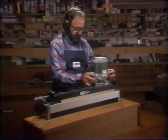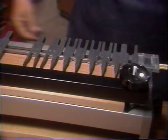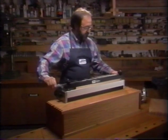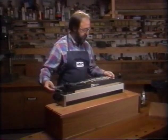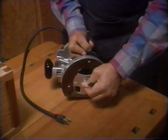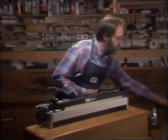While you are cutting, keep the router base flat on the guide fingers. When your tail piece is cut, remove it. Replace it with your pin piece, face side out, away from the jig. Remember, always put your workpieces against the side stop and flush up to the guide fingers. Now rotate the finger assembly back to the TD pin mode. Temporarily set the TD pin scale to the size of the dovetail cutter you used to cut the tails. You will need to change the cutter in your router because in the pin mode we will be cutting with a straight bit. To set the depth of cut, use the tail piece you have just routed and mark your pin board. Now set the straight cutter to the pencil line.